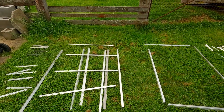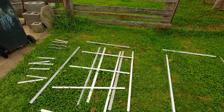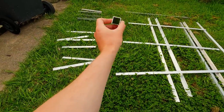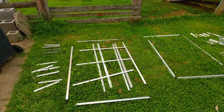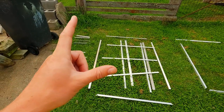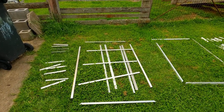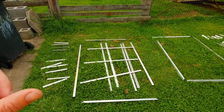And what we're going to do is just pop rivet everything together with aluminium rivets. If you did want to make this completely out of the 25 by 25 mil square tube, there is a company called Flexliner in Western Australia, I believe, which make tube connectors, which are nylon coated but have a steel core, so they're going to be super strong. They also are a bit pricey, at around about $9, $10 a join.